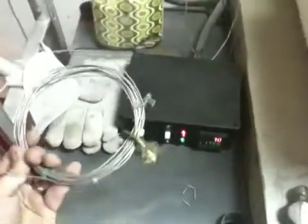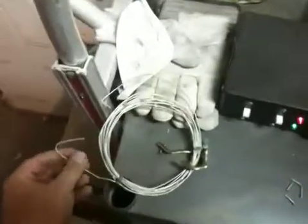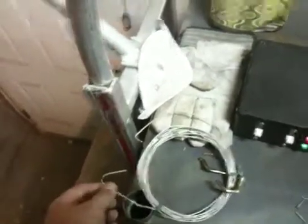I'll go ahead and turn this on. I don't know if you can hear the elements heating up — they kind of buzz a little bit. Let's go over a couple more things. This is some pin and staple wire — I use that to form some little hooks and pins to hold the element in place; you can see some right by the bends, that just keeps it from popping out. I got a soft fire brick in there I'll set some knives on. As you can see it starts heating up pretty fast — already at 110 degrees.